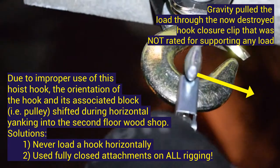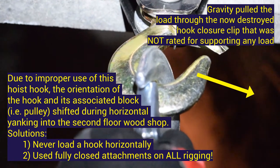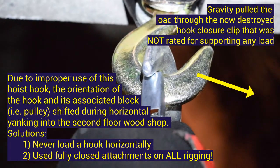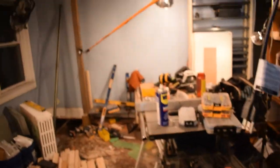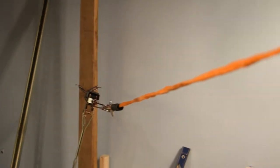Hooks are only useful for lifting loads vertically and cannot cope with a 90-degree separation of loads — it must be 180 degrees, top and bottom. You can see I was pulling with this winch puller, and just a few moments before, the weight would have been transferred and we have a failure.